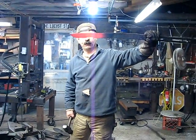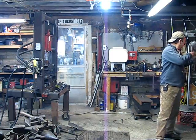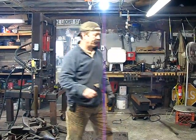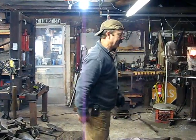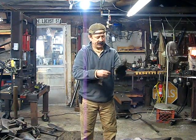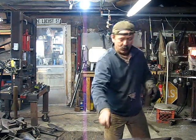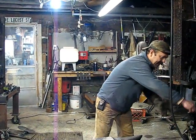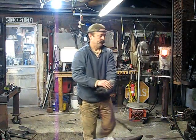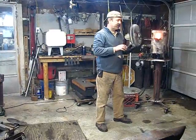Now you can see what we got. Very much what I want. And very close to the point. We're just going to do a little refinement on thickness by the ricasso, and then we're going to have to admit the fact that we have taken a piece of steel that was very happy just being what it was, and we have heated it up, we have beat on it, and now it's what I call unhappy. We're going to have to return its condition, its phase.